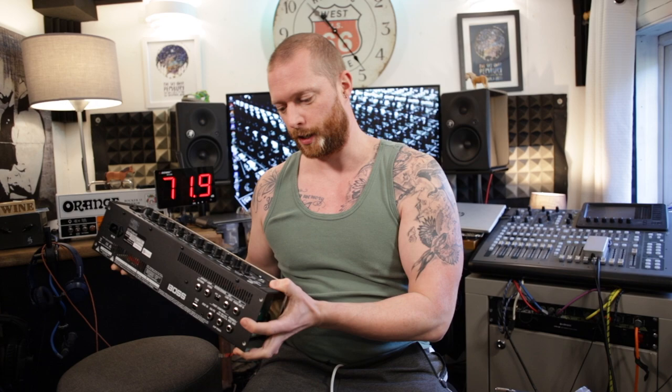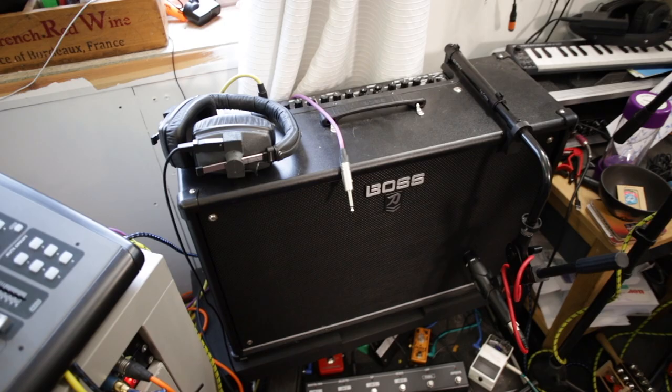I found on the Boss website a list of the outputs of all their heads and cabs. It's not as important with the watts because as long as the watts of your cab is higher than the 100W or 50W depending on which Katana you've got, you're never going to blow up one of those cones. But with the ohms — if ohms are too low on the cab it could draw too much power from the head and damage it. It looks like it's pretty safe to go 8 ohms and upwards; I'd avoid 4 ohms unless using the 50W cab. This is the amp head taken from a Boss Katana 100W combo — this is pretty much the same thing that comes in a Boss Katana head. This is from the 100W Mark II.